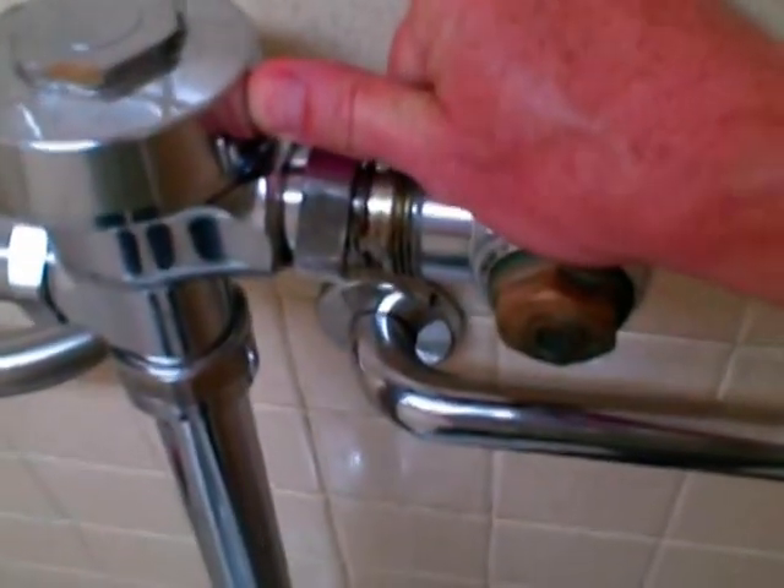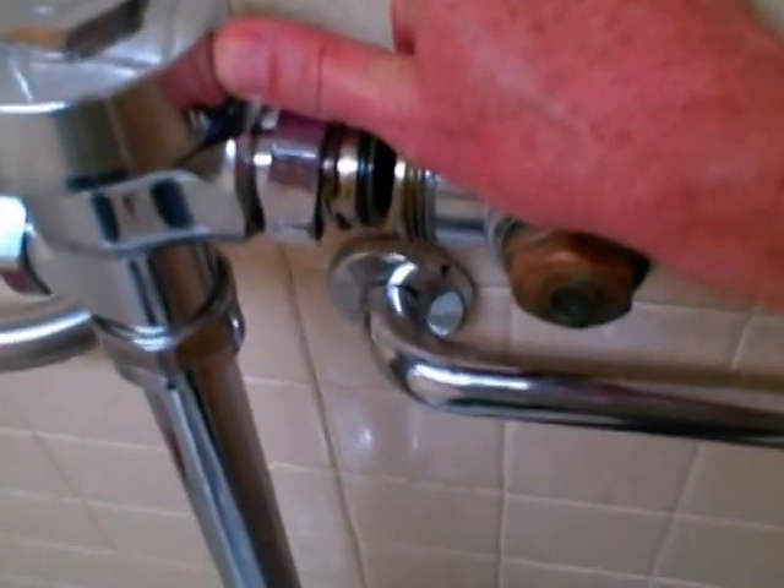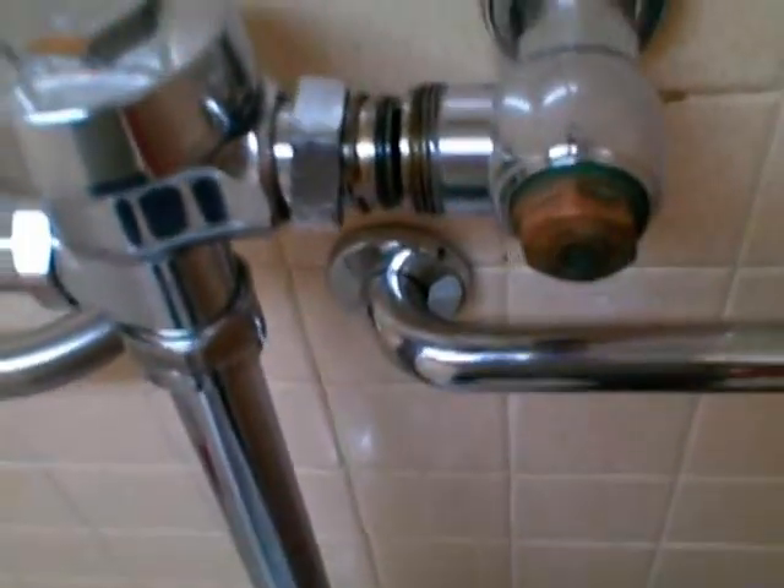There's going to be a nut and a bolt on each side of the toilet that I'm going to loosen with the adjustable wrench, and we're going to take the toilet off the floor. On the bottom of the toilet I just removed the nut and the washer, and I'm going to do that on both sides. Then we're going to loosen the nut here and this is going to pull away. You're going to get a little bit of water to come out of here, so you may want to have a bucket below that.